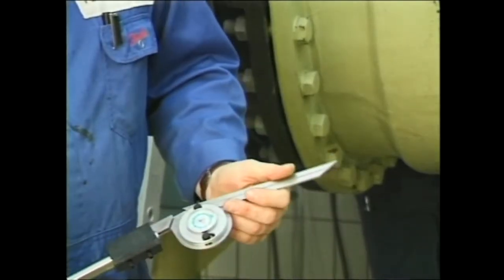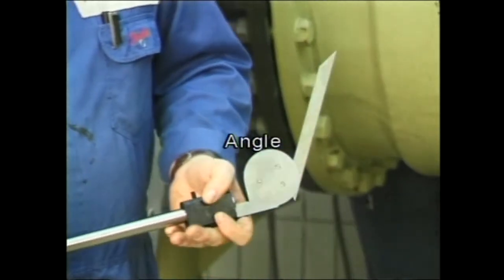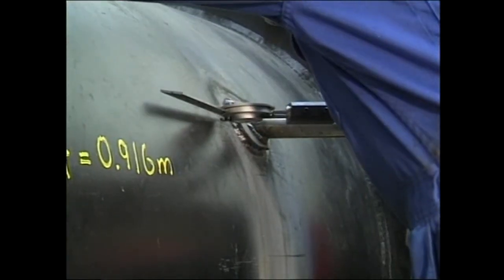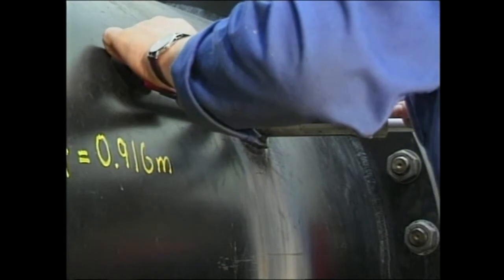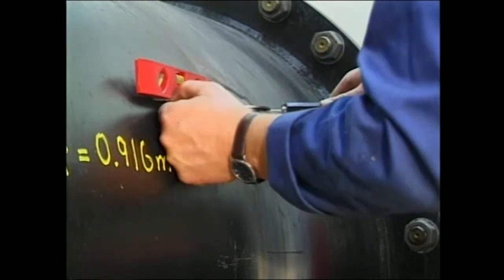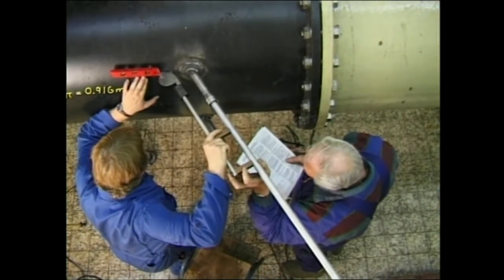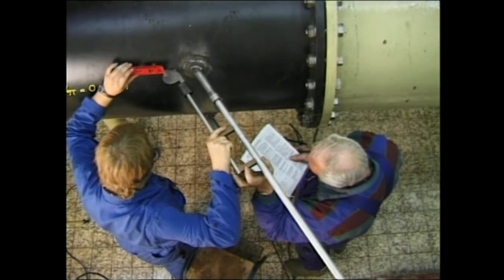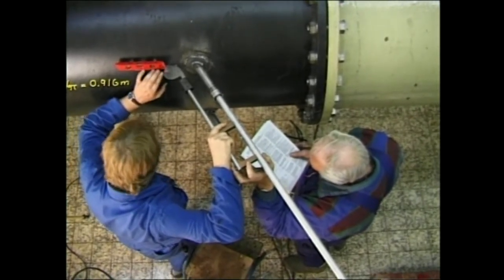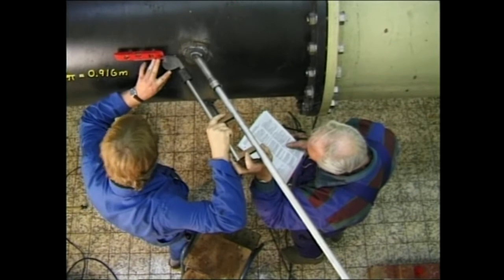When it's been mounted, the next step is to measure the new sensor. The angle of the soundtrack in relation to the pipe is measured with an angle meter as shown here. A small level meter can be applied to get the angle meter in the same plane as the pipe. It's important that the angle reading is accurate as the track angle has a great influence on the measuring accuracy. The measurements read must be entered in a measurement report, which can be found in the manual.